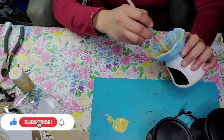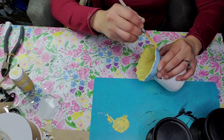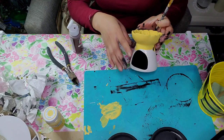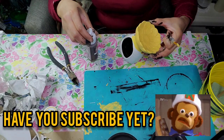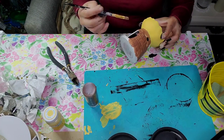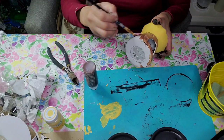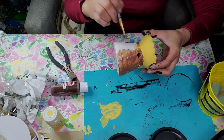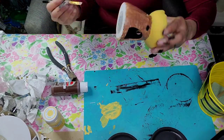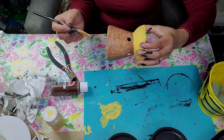For the top of the flower I'm using some maize chalk paint from Waverly and I'm completely covering the top part along with the sides — all the area where you can see the blue right now. I did two coats. Now I'm coming in with this brown paint called brown oxide, using a small brush, trying to leave a specific texture that resembles a beehive — painting in the opposite direction of the grain on the piece to achieve that look, using small strokes with variation in color.